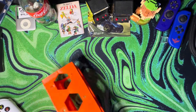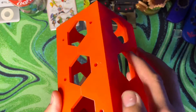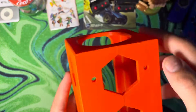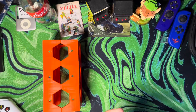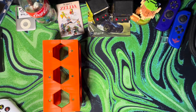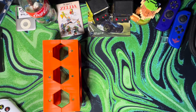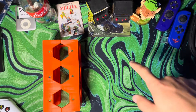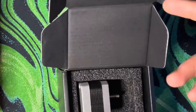Then came the next issue. There's a lot of what I'm pretty sure is called ribbing on the print, even though the model isn't like that — that's just how it printed. I couldn't figure out why. One day the printer just seemed really loud. It was the Y-axis motor, the one in the rear of the printer. It was louder than it's supposed to be, so instinctually I touched it and instantly burned myself. After about 10 seconds of research, I found out that even though they run warm, they're not supposed to be hot enough to burn you. And that brought us to needing a new motor.